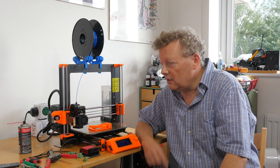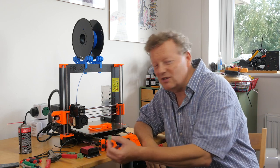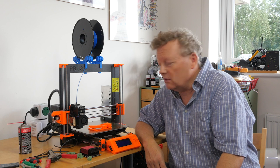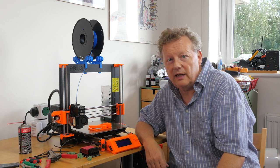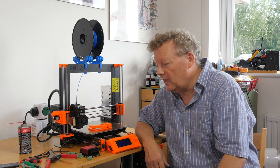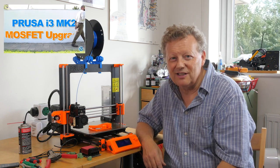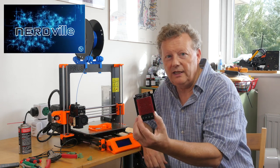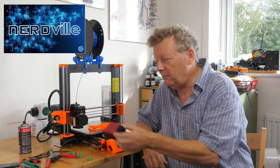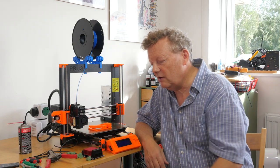Some people suggest stripping the whole board down, taking it all out, removing the actual connector and the socket — a big job. It requires a lot of skill with soldering, and soldering the power wires directly to the board, and I really don't want to do that. So I was very pleased to see a video on the channel of Nerdville, one of my favourite channels — absolutely brilliant guy who does fantastic CAD designs and great projects — and he suggested using an external MOSFET driver, taking the power out from the board to this device and back in to the heat bed. It's a great idea.